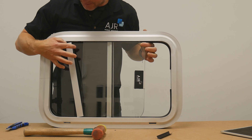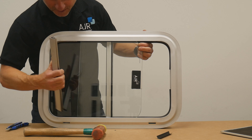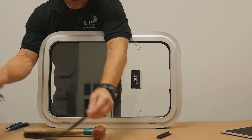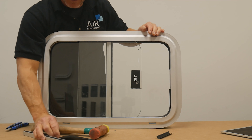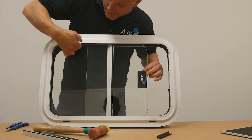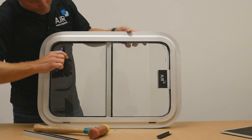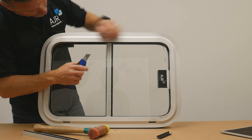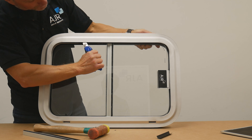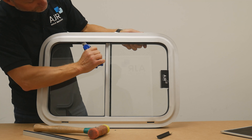Once that T-bar is removed, it will just fall right off. This T-bar can be pulled and it actually has a rubber slip inside of it. Once that's removed, the plug should all be removed as well. You can close that window slightly, then run that box knife up at the top looking for the track. Once you find the track, just slice it open and that unclips that particular piece of track.